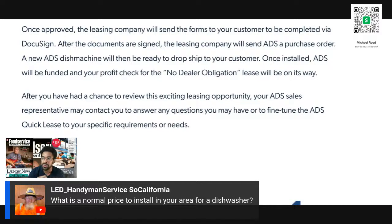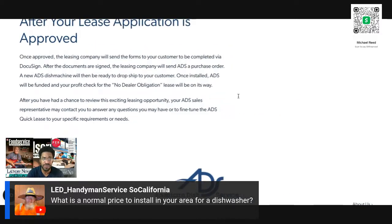Is it a corner unit? Is it going to come as a corner unit from the factory, which you should have the factory do? Do not convert the doors on a unit in the field. It will add hours to an install, plus additional cost. So all of this stuff is done in the field.